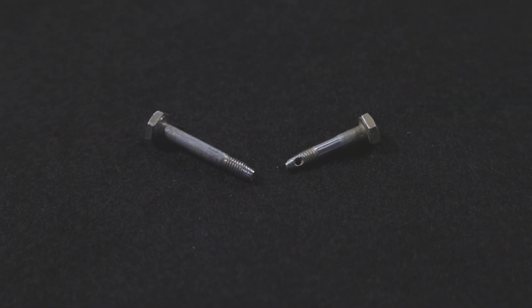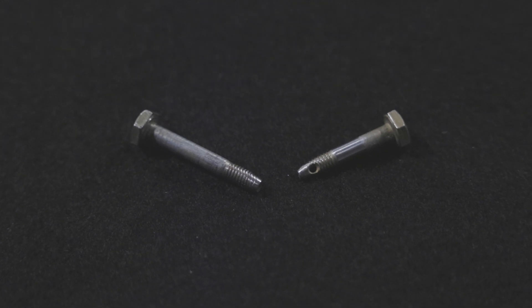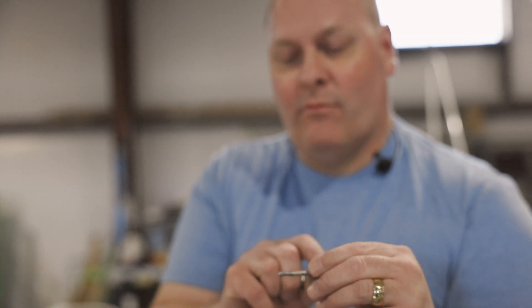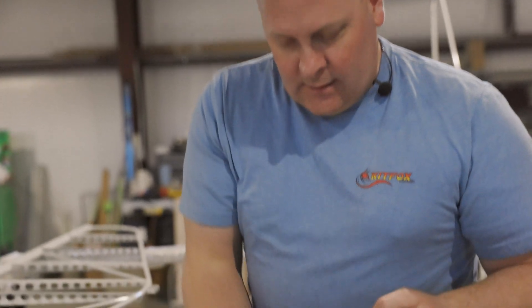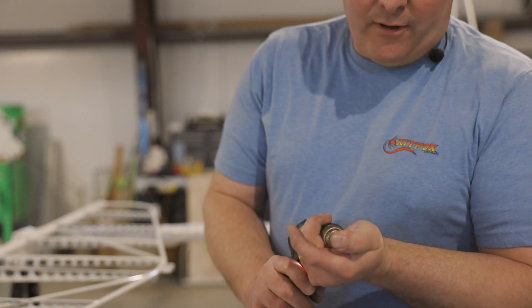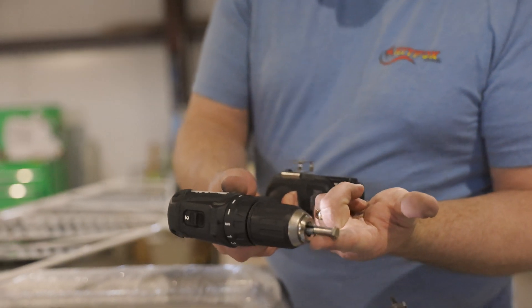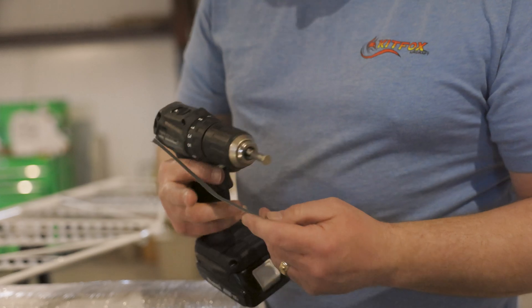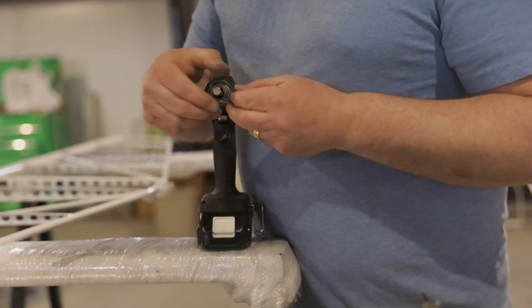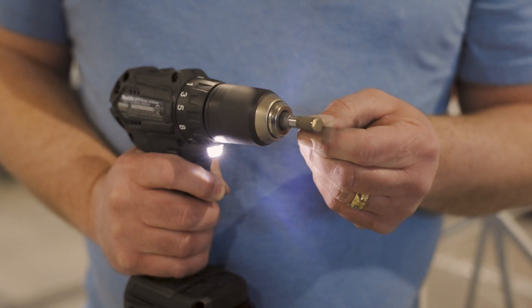Here is a scrap bolt — you can see how this edge has been tapered down to a little bit of a bullet shape. That helps with aligning stuff, and if the standard bolt won't go in, you can shape this down to a bullet and it fits in a lot easier as an alignment pin. For now, I'm going to use it as something to hold my bushing, and we can actually chuck it into a drill — I prefer doing this on a drill press. Get it good and tight up against the chuck so it's not going to rotate. Take a small piece of sandpaper — in this case I'm using 220 — and in this fashion just let that work down the outside of the bushing, going back and forth.